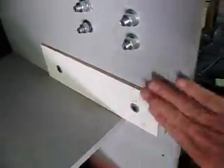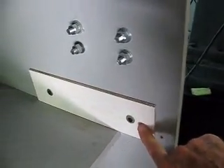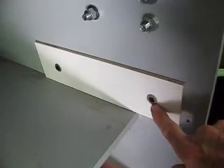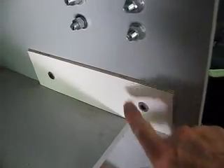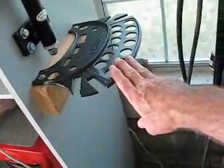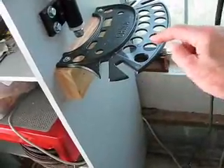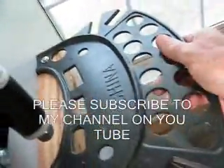I've completed the mounting now. I'm on the inside of the cabinet, and on this wall I placed a quarter-inch piece of plywood with melamine on one side. The screws with washers on them have a much larger distribution area for the pressure, so I didn't want to risk the screw heads pulling through the cabinet wall, which is about three-quarters of an inch of MDF covered in plastic. You can see the collet tray has been mounted on the wall of the cabinet, low enough so I can see the tops of each R8 collet where the size increments are marked. It's plenty strong and in a convenient location.